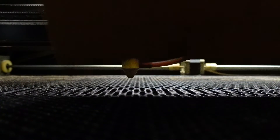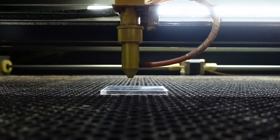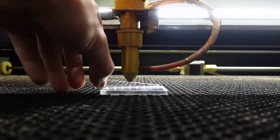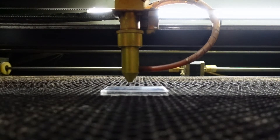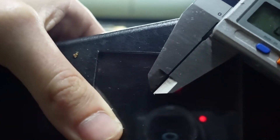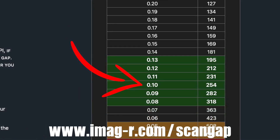Remove the wood and put our clear acrylic piece underneath. Measure the distance again with the ruler. Now give one pulse to create a small dot on the acrylic. We will use our caliper to measure this dot as accurately as possible. Make sure to measure it on the back side, since the entry angle is always bigger than the actual dot. For me it is 0.1mm. From the scan gap and DPI table in ImageR, we can see that we have to use 254 DPI for 0.1mm. Now we finally know our needed DPI.